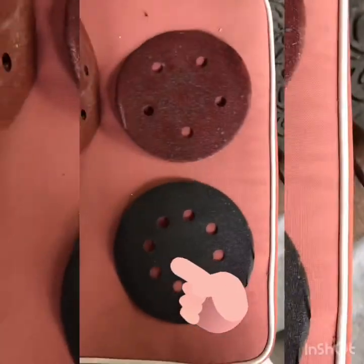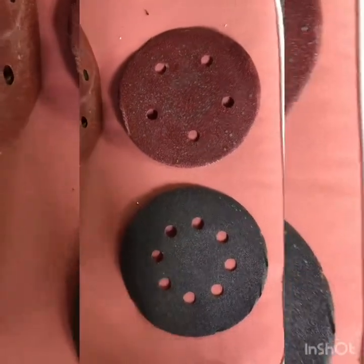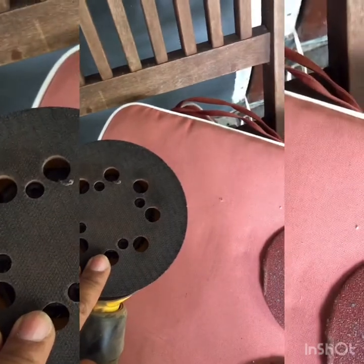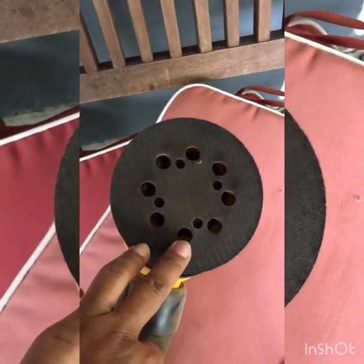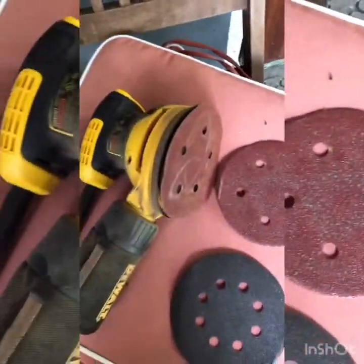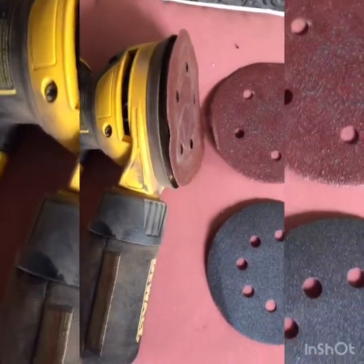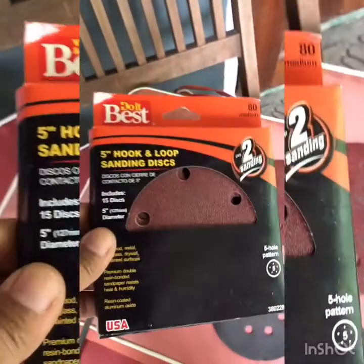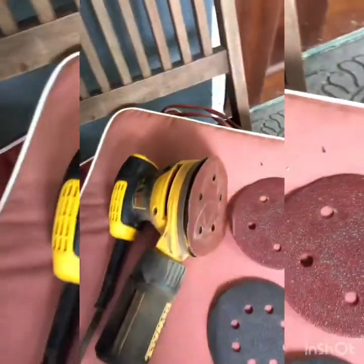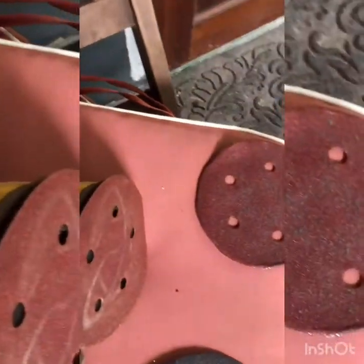This hook and loop 8-hole 5-inch sanding pad is from North Coast Hardware — it's what my sander uses. The other one I have is a 5-hole. My sanding pad has an 8-hole pattern, so I need to use an 8-hole pad — that's where the vacuum suction is. The 5-hole pad I got at Kennedy's Hardware doesn't fit the hole pattern so not as much dust gets suctioned up. This is why you have to shop around — those are $31.54 at Kennedy's versus $12.95 at North Coast Hardware.